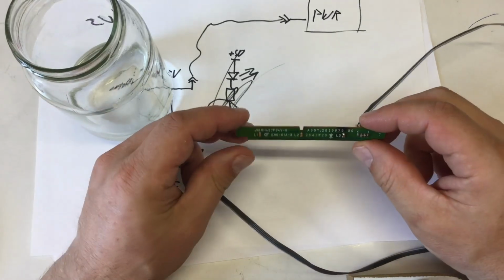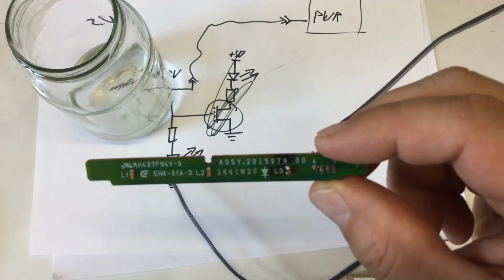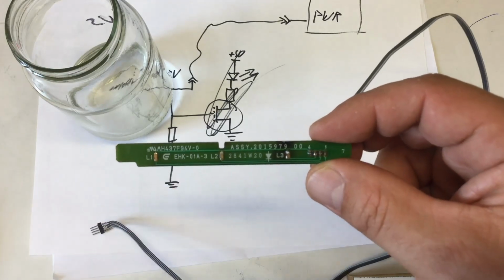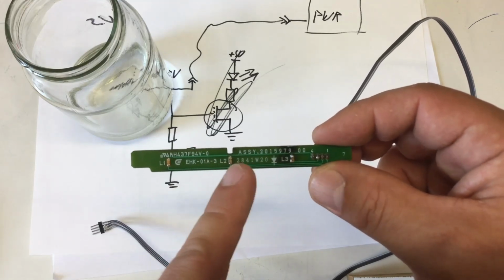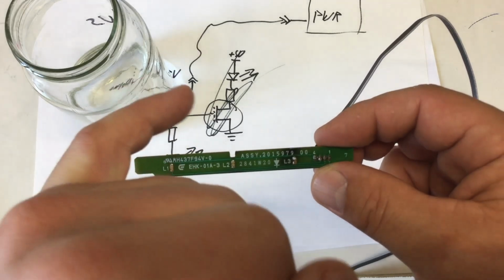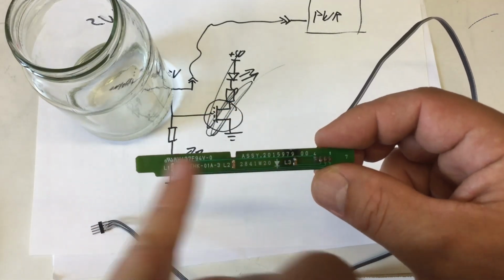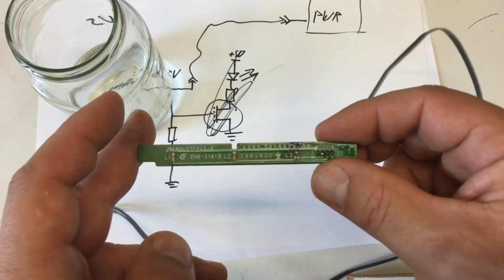And you see how I slightly burned the board, especially here at that one. So in the second try I lowered the temperature, and since I can't get the airstream down any further, I will use next time a one size bigger nozzle so I won't blow away my parts. Okay. I'll put that in the case and then we'll see how that looks.